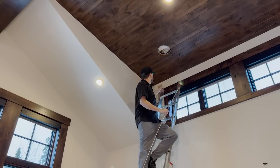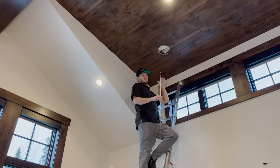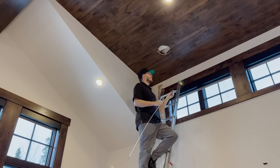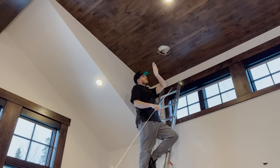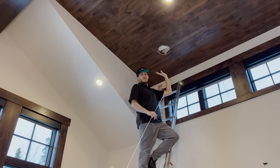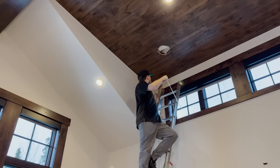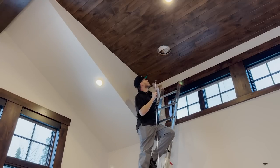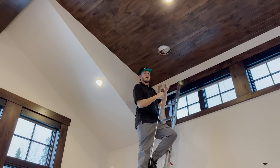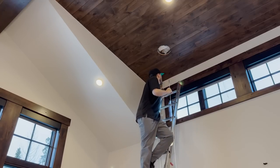To get around this corner I already drilled through the top of the header, which is two two-by-fours, and there's a little gap between the roof and the studs running this way holding up the plywood. I'm going to take my fish hook and hook some Romex electrical cable I have coiled up in there, grab it, attach the lines with electrical tape, and pull it all through. Wish me luck.